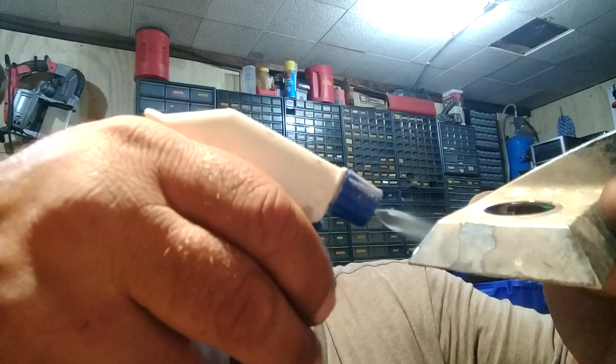With a plumbing fixture, you probably think it's chrome brass. But when you grind it, you can see it still stays silver. Spray it with your solution, and it instantly goes black. That's die-cast.